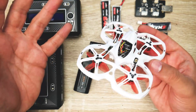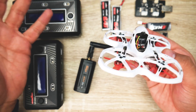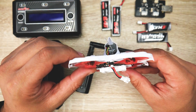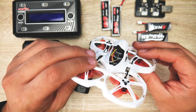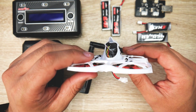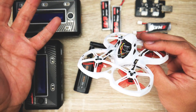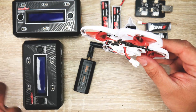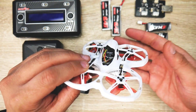For the camera, something I really love — they're using a RunCam Nano 2, where you can actually see where you're going, so you have a proper flying experience. For the video transmitter, I've been running it on 25 milliwatts indoors. I do have thick concrete walls, however it does pretty good compared to other ones I've used on 200 milliwatts. You can bump it up to 200 milliwatts, but you'll get less flight time because the video transmitter will take more power.